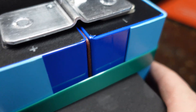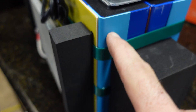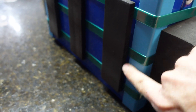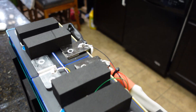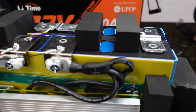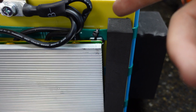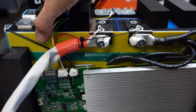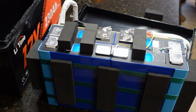Overall this is kind of what you'd expect to see in a battery like this. Because it's rated for trolling motors, it's got to be a very beefy BMS in order to handle the current. A lot of batteries on the market say they can handle their rated output continuous, but some cannot — not because the cells can't handle it, but because they use a cheap BMS. Between the cells there's a matte insulating material to keep them insulated from each other. On the corners they put hard plastic bits to keep them from getting squished, and the whole pack looks like it's being compressed by green plastic compression bands — three of them on the back, which should be plenty. None of the cells looks puffed or swollen even after the hard test. The overall pack quality is okay — nothing crazy or horrible stands out.